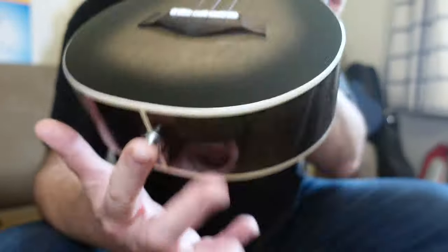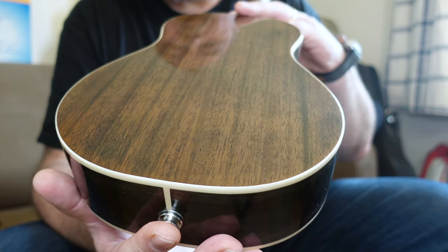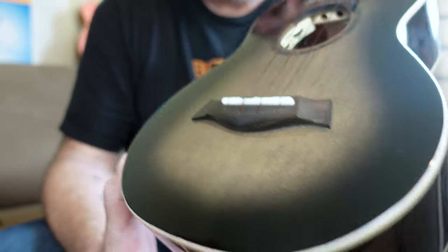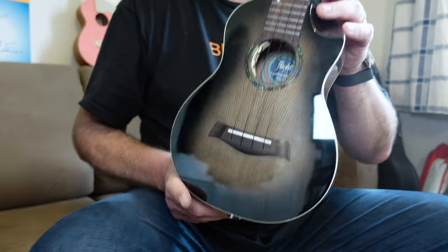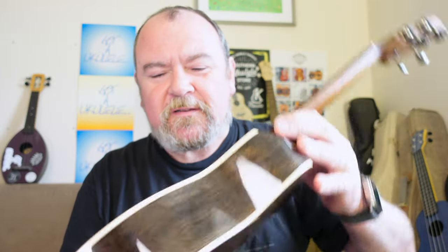Normally I'd deal with this sort of stuff under the decoration, but let's deal with it now. The back is kind of a walnut-y brown colour — natural wood. But the sides and then onto the top in particular is what they call their moonburst colour finish: the whole thing is stained black, then the inner section is buffed out so you can see the spruce grain under it in a kind of ghostly grey. I think that is absolutely killer to look at. I absolutely love that look and that contrast. That's a really nice colour.